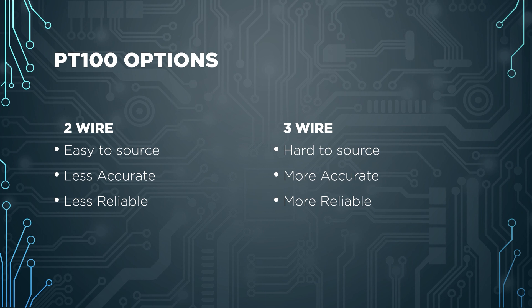Two-wire sensors have no way of combating this noise. With a three-wire sensor, by measuring the resistance of the wire that connects to the same pole of the sensor — basically doing a U-turn, going to the sensor and coming back without going through it — the MAX31865 chip can find that wire resistance and subtract it from the measurement, giving you a more accurate and cleaner reading. This fixed my problem, though most people don't have problems with two-wire sensors.